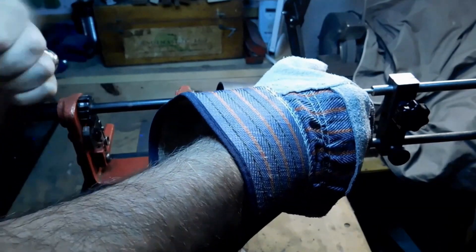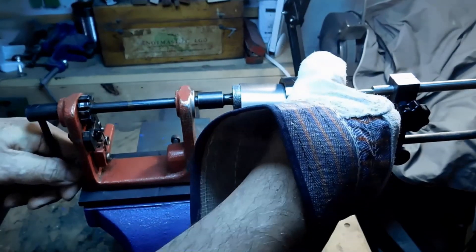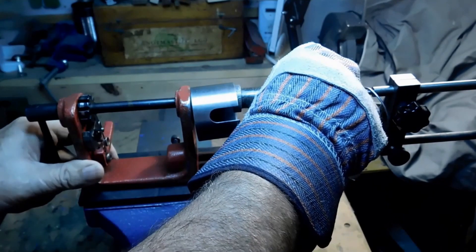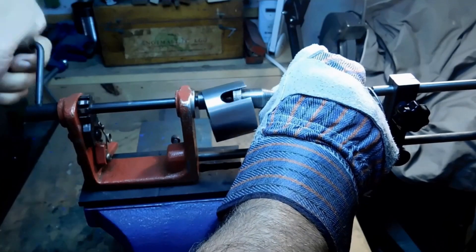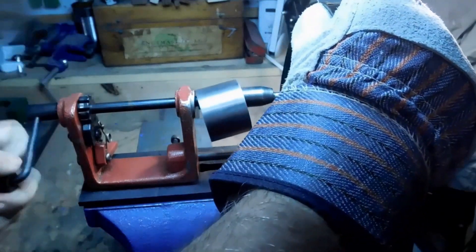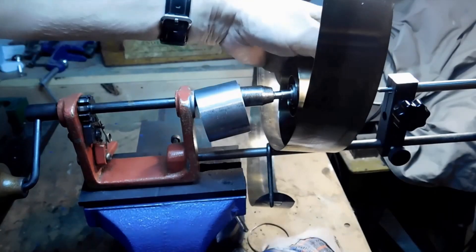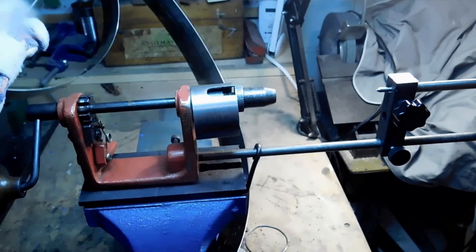There we go — the bailing wire is off. It still has to get smaller to fit in that sleeve. Let's release the mainspring now — this is the exciting part. When you release it and start to unwind it you have to be really careful you don't let it get away from you; that handle can do a lot of damage. There we go — we're just going to unwind it so that we can clean it. Let's get it off of there.